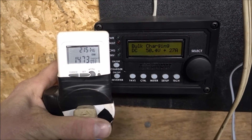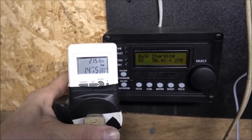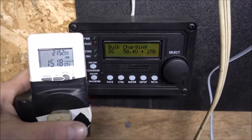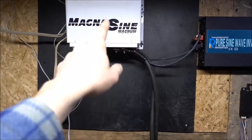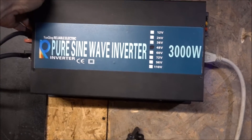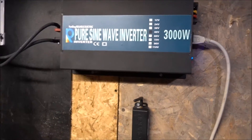The fans on that inverter just kicked in again - that's good, that's cycle number three. We've got 1400 to 1500 watts coming in, going up and down because it's keeping to a threshold. We're doing pretty good. The charger is running this inverter, so it's charging the batteries and now it's running the inverter. Fans are still on, doing a good job. Everything seems to be working nicely, fans turned off, everything seems okay so far - just going to keep testing this thing for a while longer.